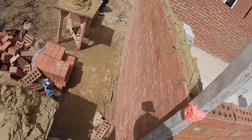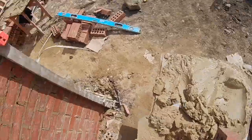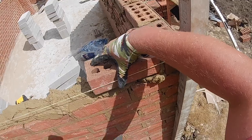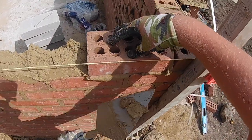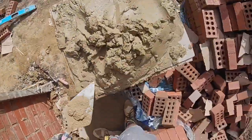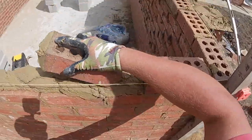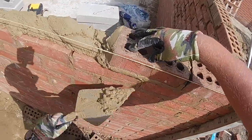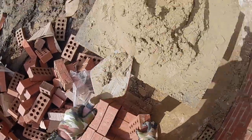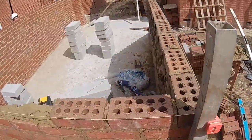I've been doing extensive traditional work over the last good week or two, and a lot more traditional for the past probably month, and it definitely has its carryover effects. One style of laying bricks does carry over to another. If you're fast at pick and dip, you're going to get faster at traditional, and that's one thing I've learned. And vice versa, the faster you get at traditional, the potentially faster you can become at pick and dip, but obviously pick and dip is a very foreign movement compared to traditional.